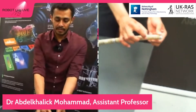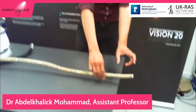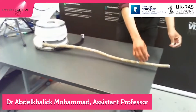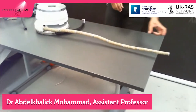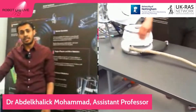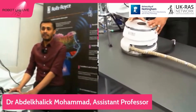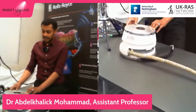In order to improve the design, we came up with a solution that, instead of a single backbone, includes a twin backbone. The snake body consists of different sections, and each section is driven by three cables. By manipulating these three cables, you can bend a single section in different directions, giving the snake flexible movement. Each section is driven by three cables, and here we have eight sections, so in total we have 24 cables going to the actuation pack, where we have 24 motors to control each section individually and simultaneously.